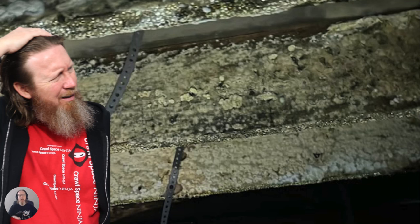It's super easy to tell if you've got mold here — this is an easy one. This wood is covered in wood rot fungus. It most likely should be soda blasted, but also look at all the bumps — this could be moisture buildup on the wood. You never want to go into a situation like this without drying the wood, lowering the humidity, physically removing the mold, and then applying some type of disinfectant or peroxide.